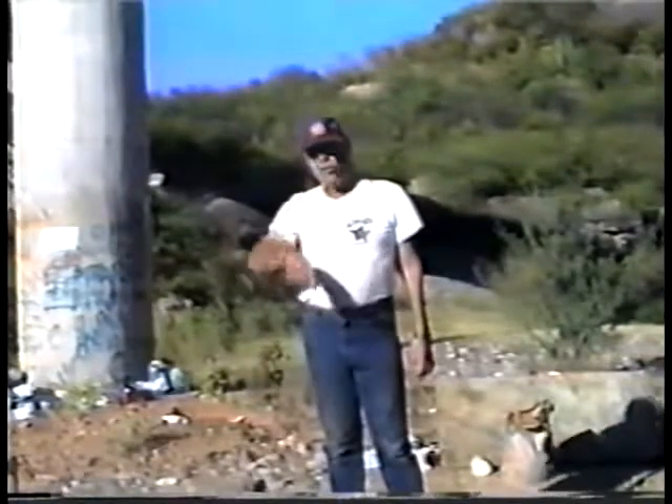This is really the heart of the gold recovery system, and it's what's going to make you either recover most of your gold or nothing. This table covers probably better than 98% of the gold, down to about 400 to 500 mesh. So this is really important when you're working a real fine load — you don't want to lose it. Let's go through a step-by-step process and we'll show you how it goes.